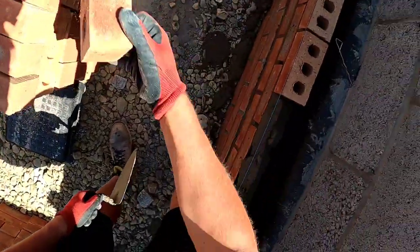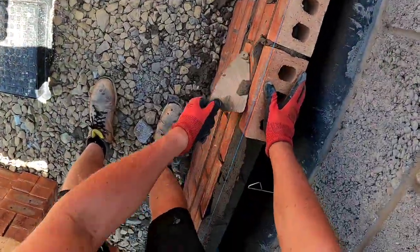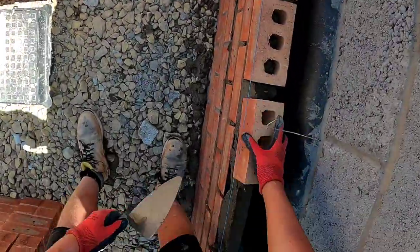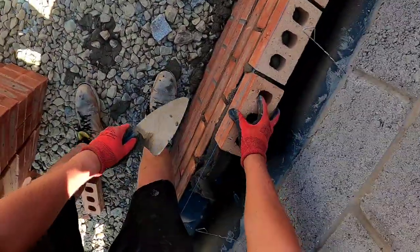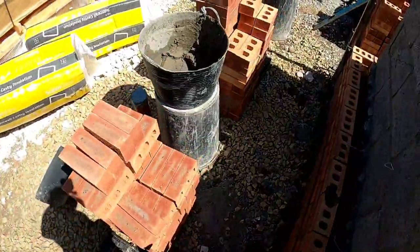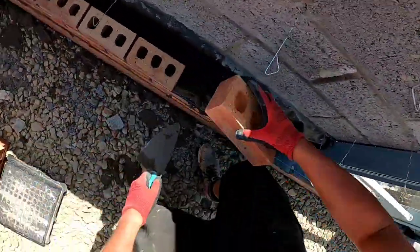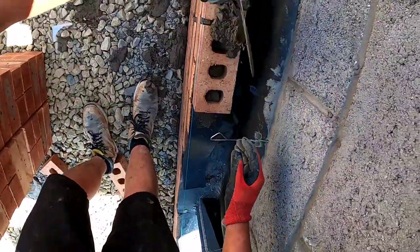If you put your insulation in with about three courses showing above your brick, it reduces all your mortar squeezing out into the actual cavity. You have to lay the brick a slightly different way — that's why you need to minimise the mortar scraping out the back. That's why you see me angle the spread when I'm picking and dipping away from the cavity — you angle it, and it just stops that squeeze out into the back. You don't want that excess mortar filling the cavity.